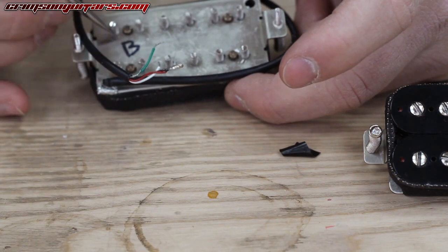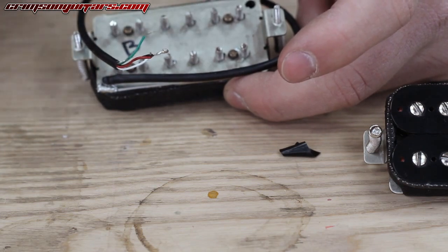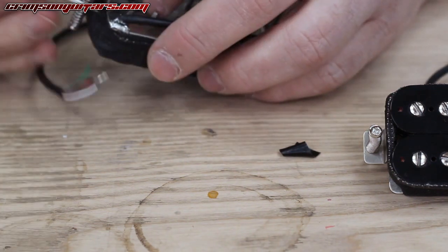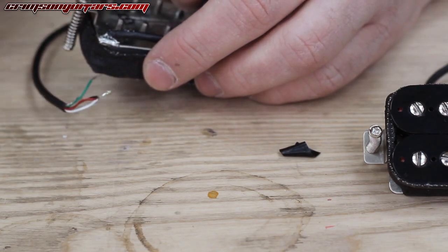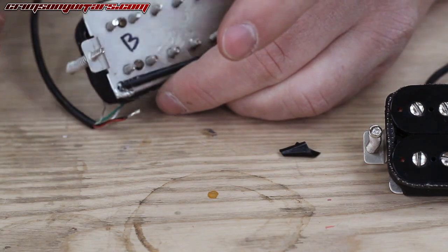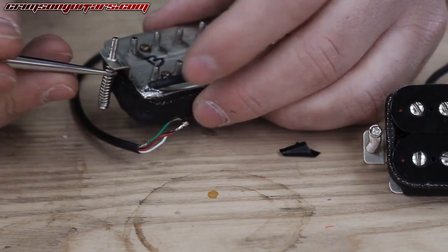I've got no problem with there's no engraving and he's handwritten the B on there and all that. That will come with time. But this here is just a little bit where the wires go in. You're supposed to have the strengthening bit, well, it's not shielding, but the outer sheath of the wire is supposed to be through the hole and supporting everything, and it's not, it's all just hanging a bit loose.